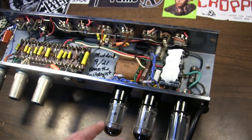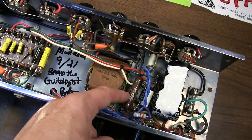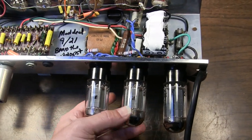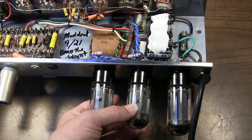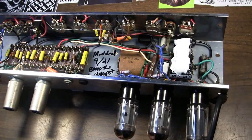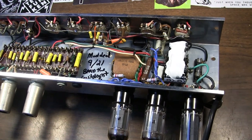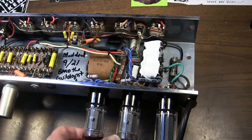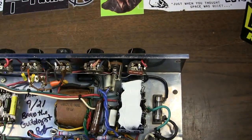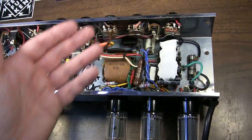You just have to basically do your best, because what ended up happening when I tried to lower this value, I tried 100 ohms, 30 ohms, 0 ohms, directly to the chassis. And it did get the plate dissipation per tube up, by going direct to chassis, to about 9 watts per tube, which is close to what they're capable of, but still not all the way. But the problem with doing that was, first of all, if you go to 0 ohms, you have no bias resistor. You can't put a bypass capacitor in and raise the bias on the output. The other problem is, when doing that, the tremolo would no longer operate, because the tremolo operates by varying the bias. If it can't do that, then it won't work at all.